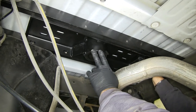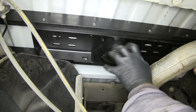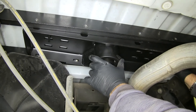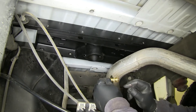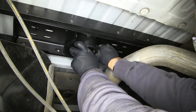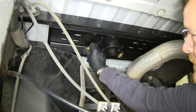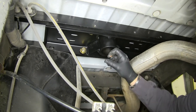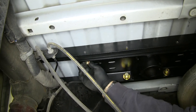Now we've got our center section in place. We're going to put a bolt in on each side just to hold it while we install the rest of our hardware, using the same half-inch hardware — lock washer, flat washer — just finger tight for now. All of our hardware connecting the center section to those crossbeams is going to be the same combination: half-inch, lock washer, flat washer.